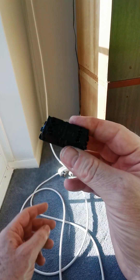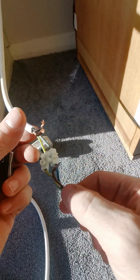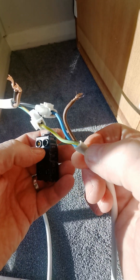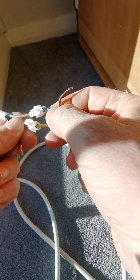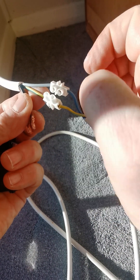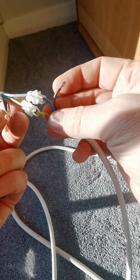Although I'm not a spark, this is counterintuitive in many ways. There's a four-core cable coming from the awning outside and then the usual three-core cable which comes from the power supply inside. I discovered that it's correct in this case to wire the neutral wires together with a connector, and also to wire the earth together, so you've earthed it essentially via the plug.